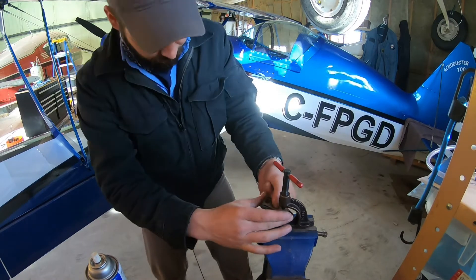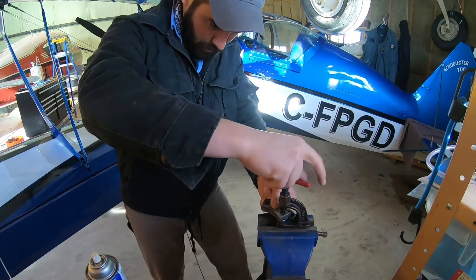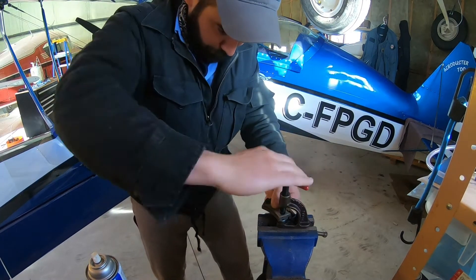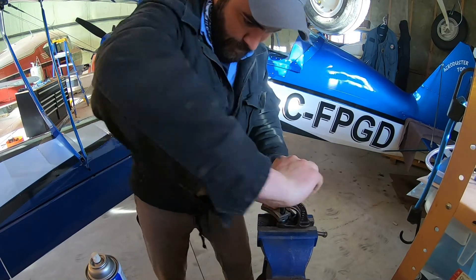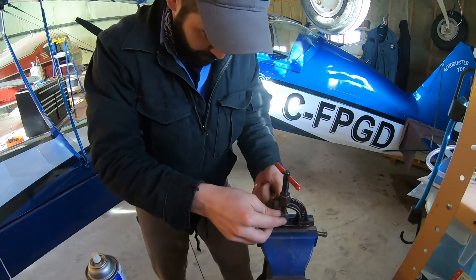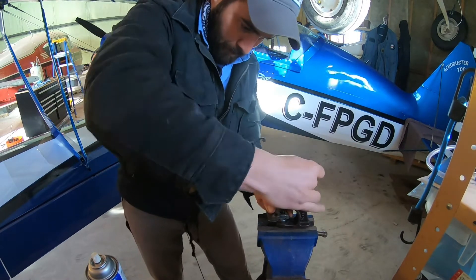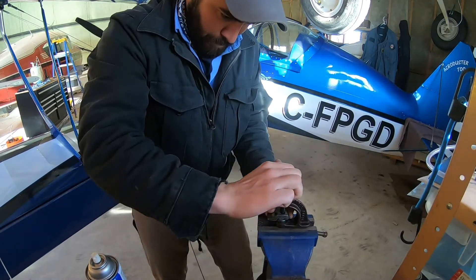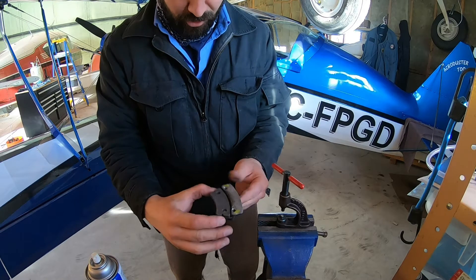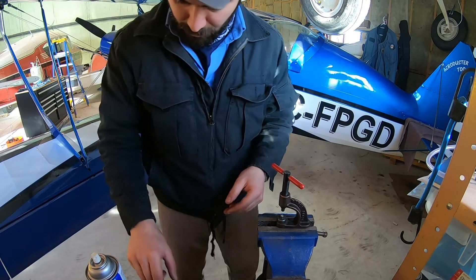Keeping my finger to stop the other rivet and holding them down, I've got that really nice flat surface — nothing going to cause issues. Get it squared up and set the rivet. These are really nice holes with no play, which can otherwise be a problem; if that is the case you really do need to replace them. And there we have it — a nice new pad that hasn't been contaminated with hydraulic fluid to go along with our nice new rotors.